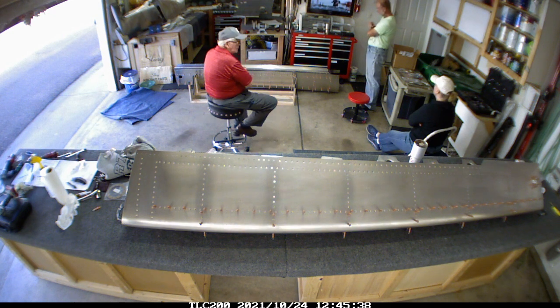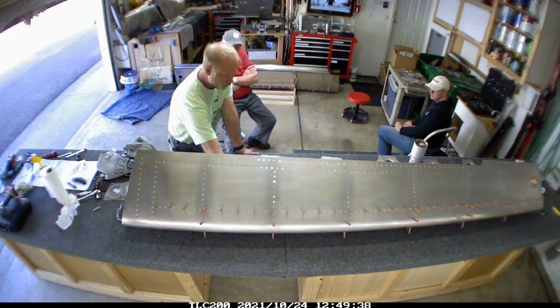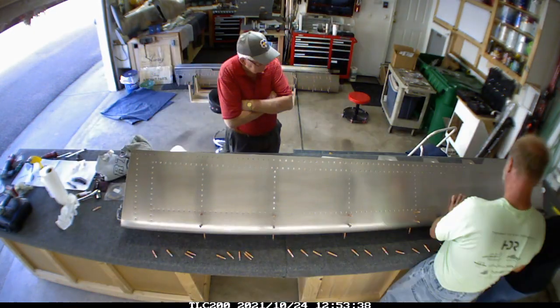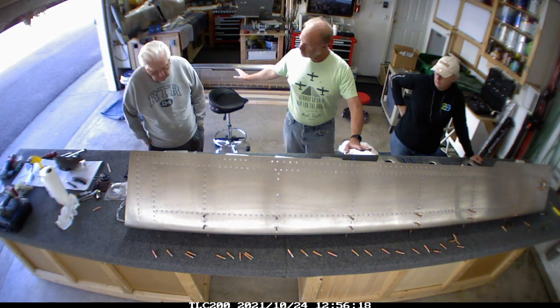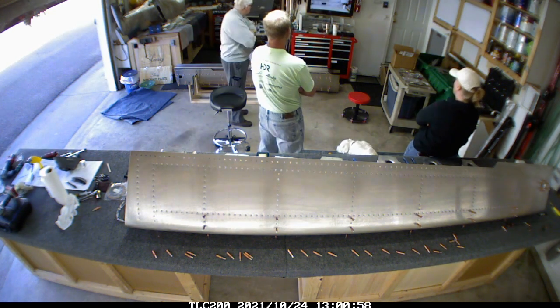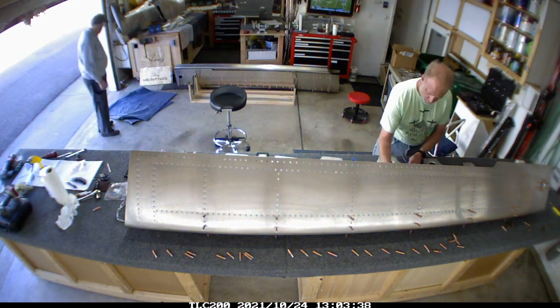This is a pro seal day for one of the wings. Lori and my father-in-law Harold came over, and we basically reviewed the video from Evan and the Sling factory on what we were going to be doing and how it went together, then worked on prepping the tank itself. I wanted to make sure everybody was on the same page, because once we start the mixing process the clock starts and we've got about two hours to work with the material.